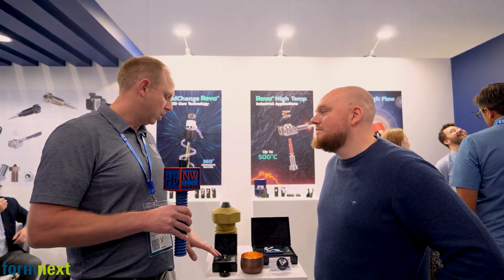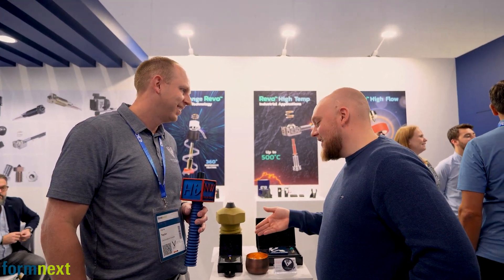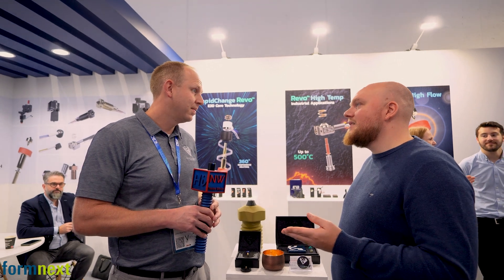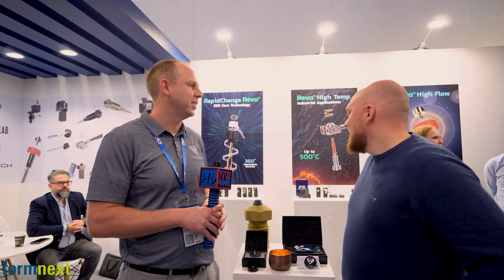As I mentioned, the Revo — we just launched that. That'll be sold exclusively through E3D, and the sale price is 150 pounds. I actually love the Revo. I really like the quick-swap ability of the Revo. Exactly — it's awesome. You just turn it out and you can swap your nozzle. Very easy, even cold — you can change it cold, just make sure the filament is retracted. You can change sizes very easily, change nozzle types easily. It's a super robust system.